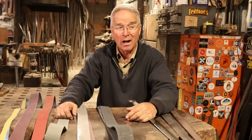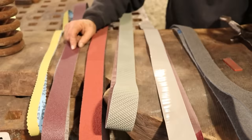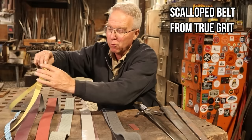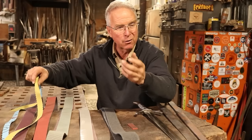Here are samples of the things most often used in knife making that K&G sells. These two are aluminum oxide belts. Aluminum oxide should be thought of as sandpaper — it breaks down like sandpaper, it's less money, and the advantage is it breaks down evenly, giving you a progressively finer belt the longer you use it. This one is only one inch wide, and that scalloped edge allows it to conform and roll around to get to the inside radii where the knife or bolster meets the blade, or the wood meets the brass. It works really nice for getting some inside shapes.